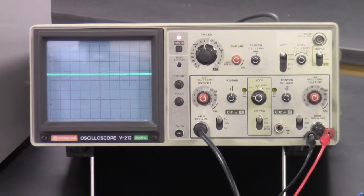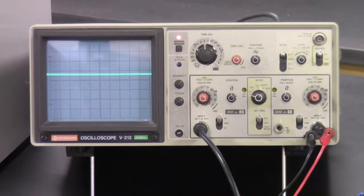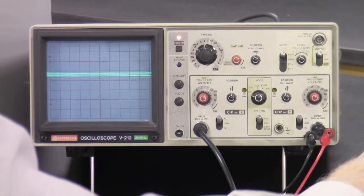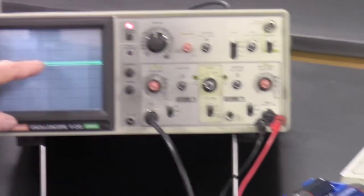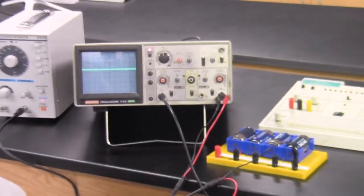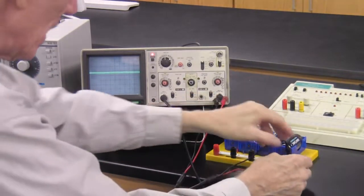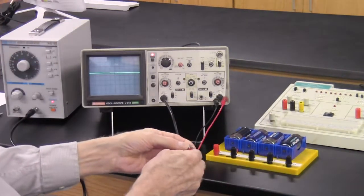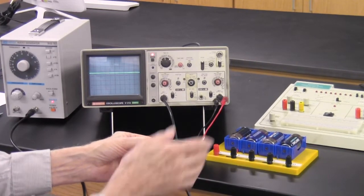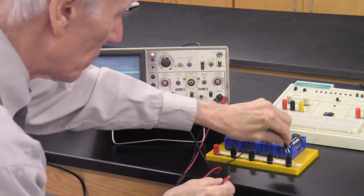The first thing we're going to do is measure some DC voltages. Here's your battery pack — you've used that before. The black wire is ground and the other is the live wire. When I hook it up, you'll see noise picking up electric fields from the high voltage fluorescent lights. If you want to get rid of that, connect the two probe leads together, which prevents you from picking up any stray signals from whatever's going on in the room.